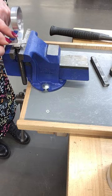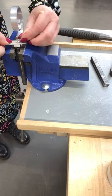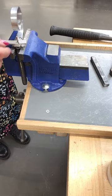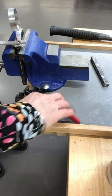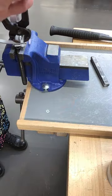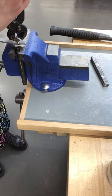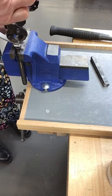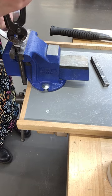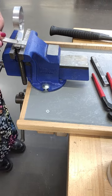The length of this rivet is too long, so we need to trim it to about the diameter of the rivet — three and a half millimetres. I'm sitting a spare rivet on the side as a guide, then using end cutters: feed them down until they sit on top of that spare rivet, squeeze them together, and cut the rivet to just above the diameter of that spare rivet.